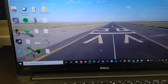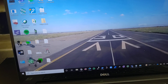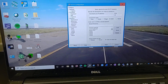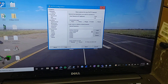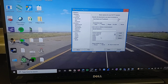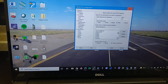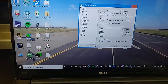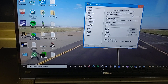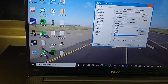You're going to want to download some sort of terminal emulation software. My software of choice is PuTTY, but there's also Hyperterminal, TeraTerm, and all kinds of others. I like PuTTY because it's lightweight and easy, and you can save different sessions. Since I'm using a COM port, I've already saved different COM sessions for the different serial port adapters I have. I know I'm going to be using COM5, so I'll go ahead and load COM5.